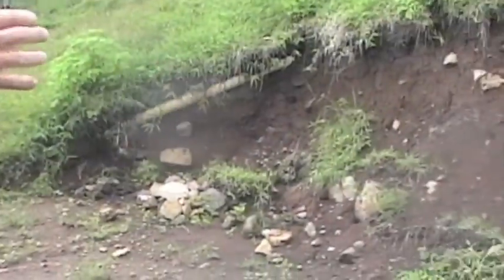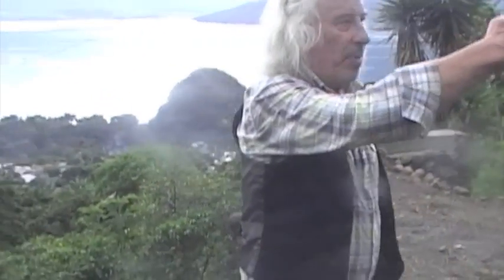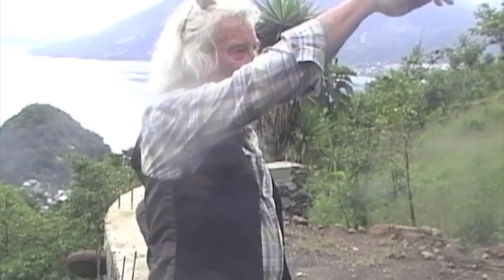There's a lot of moisture in these hills. So we would go in with a vapor barrier — maybe a couple feet behind our tire wall — and put a vapor barrier down, probably lap it back up on the tire wall, and make a swale around each one of these units to take water off. To take the hill water that soaks into the ground and take it off and out the front before it gets to the rooms.